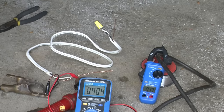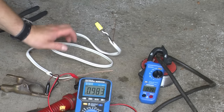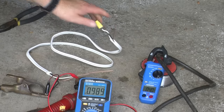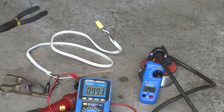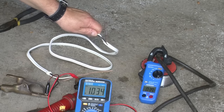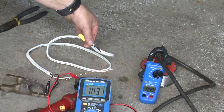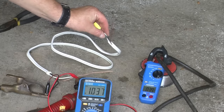Let's try 40 amps. We've almost got 1 volt across the wire, which means essentially 40 watts being dissipated in this short length of wire, and it's certainly getting warm. You can imagine that in a bundle of wires or in wires in the wall between insulation, it would be uncomfortably hot. The mar connector is probably the coolest of everything around here, although the wires near it are quite warm.